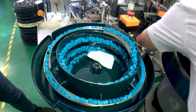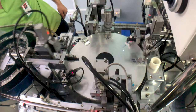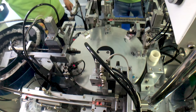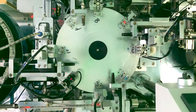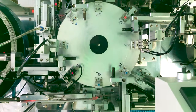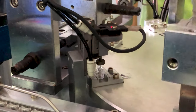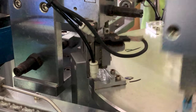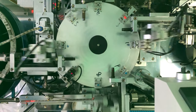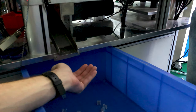Looking at the center point of the assembly machine, you can see that there is a big circular plate with eight jigs on it. In those jigs, the bottom case is installed and every other part of the switch is installed on top of it. It starts at the top where it installs the bottom case into the jig, then it turns counterclockwise towards the spring station where the spring is installed onto the bottom case. Then — very cool — this little station already does a quality control on the spring. Then it goes to the semi-final part where the stem together with the top case is installed on the whole switch. In the final part, all the way to the right, the switch is taken out and dropped into the tube, where the switches come out into the bucket.